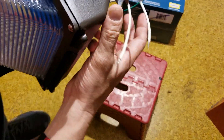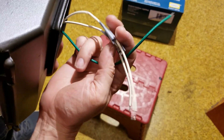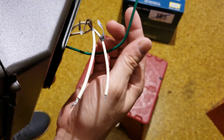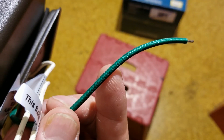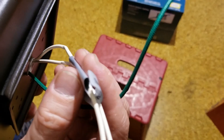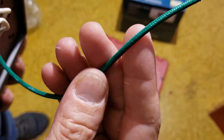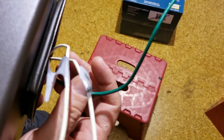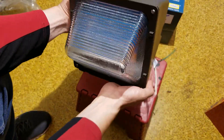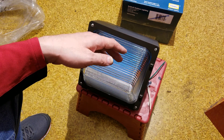This is a nice white light instead of the high pressure sodium orange light. This unit comes pre-wired for 120/277 volt to make it super simple. Notably, the ballast or transformer wires are 105 degrees Celsius rated, and on the ground wire they're actually using super high temperature fiberglass insulation.